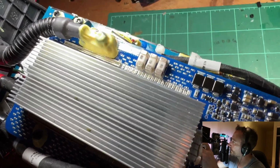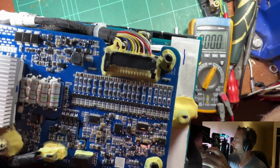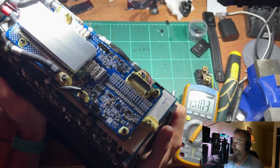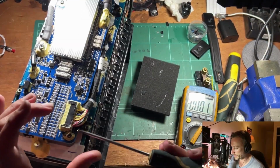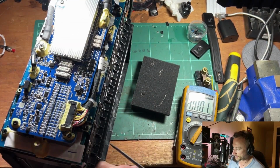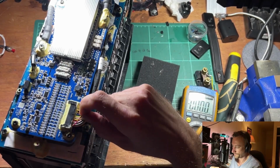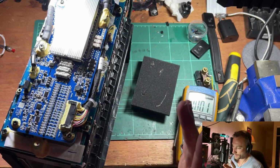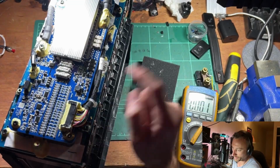metal soldered on. And we're going to have to peel the sealant out of that connector and get it apart so we can read the different cell voltages. Let's turn our attention to this connector. Got to be careful with the plug because it's got to go back in, but all these wires are connected to cells, so if this got shorted to ground somehow, we'd be in very bad shape. It'd just absolutely fry that thin wire back to the cell.